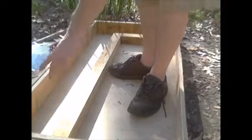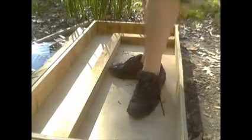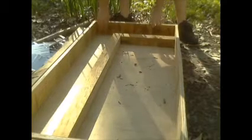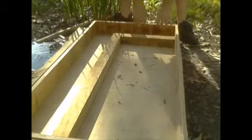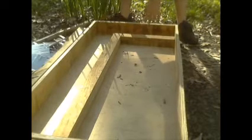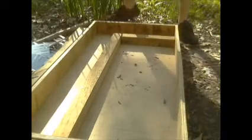Basically what's going to happen is the cold air will be coming in from here. I know cold sinks, so it'll come in from up here, come down, go along down here, and then slowly be brought up through the top. I'll have a piece of metal over top — the holes over here will be smaller and gradually get bigger. The cold air will be pulled up by convection as the air is heated.